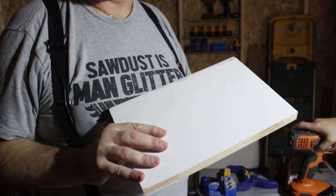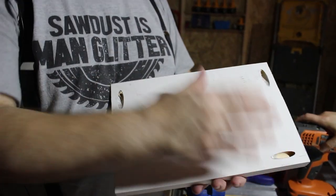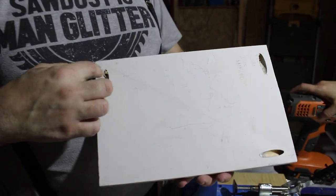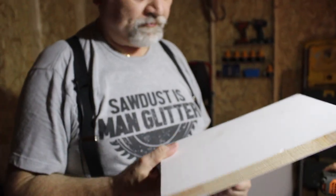So these molding shelves are not designed to carry a tremendous amount of weight. They are designed for little DVDs, CDs, games, or knickknacks for decoration. And we decided that the primary strength will come from pocket holes because in our specific application we have good wood to go through. So we have two pocket holes oriented this way and one this way, and that will make it look like it's elevated, right? Okay, so we're going to do the remaining two and we're going to be right back with you.